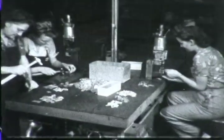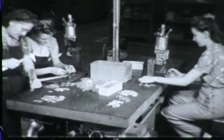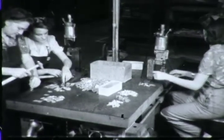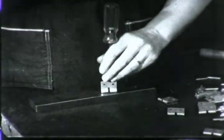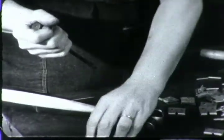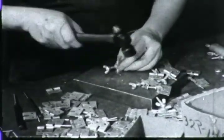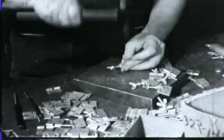Watch these one-arm bandits. Three operators were required to maintain production on these intercooler clamp assemblies. Sixty-four clamps are used on every Consolidated Vultee Liberator Bomber. Each woman is only using one arm for productive work, with the other arm idle while she is using her hand as a holding device. The ears of the hinge must be spread apart to allow for easier insertion of the pin. Notice the inaccessibility of the hinges and the disorganized condition of the workplace. The pin is then hammered into the loop of the hinge and through the hole in the eye bolt. The left hand not only holds, but must align the eye bolt to allow the pin to go through. One-arm bandits? Yes.